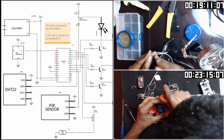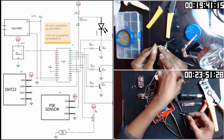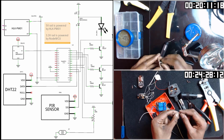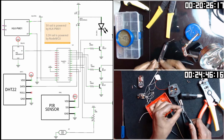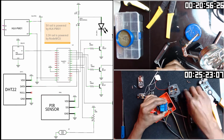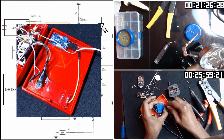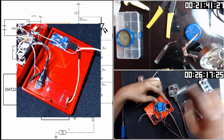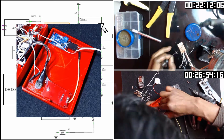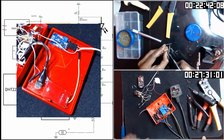One thing you need to decide here. The full system has 6 junctions that would need a 3.3 volt rail. The non-solder version would only need 3 junctions. That works out fine as NodeMCU has 3 pins with 3.3 volt. So you can use DuPont for a straight connect. Otherwise, you will need to figure out your cable management. In my case, I hooked up all components on this top part with one cable passing this 3.3 volt and brought that cable to NodeMCU.